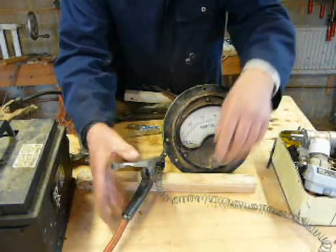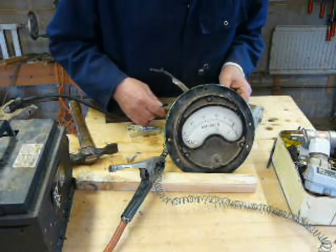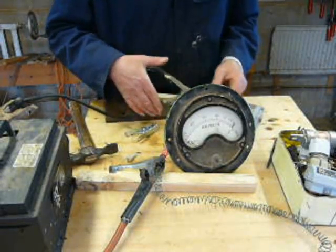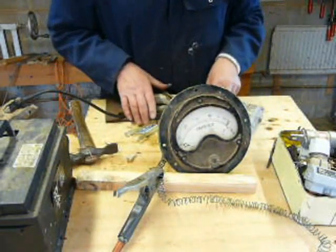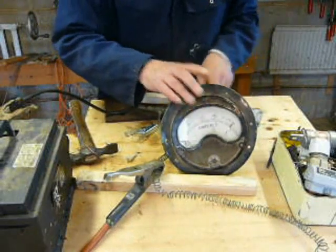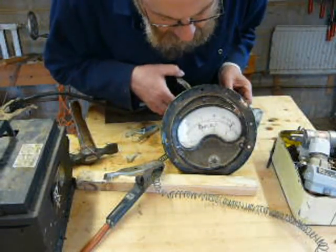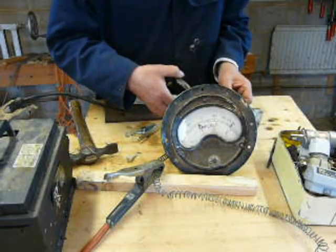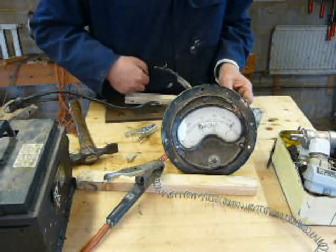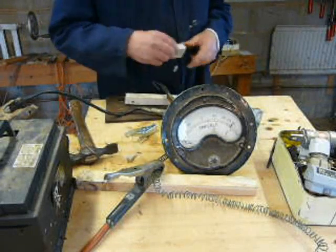So let's just go back a bit. It says 16 amps, okay? Switch it back on. It should have cooled down a bit now. It's drawing 38 amps and then it's tripped out. Let's go back a bit more. Haven't got a contact there. Stay there. Switch it on. Right, 26 amps. Still not tripped. Yeah, things is getting warm here. There, it's gone. So, not suitable.